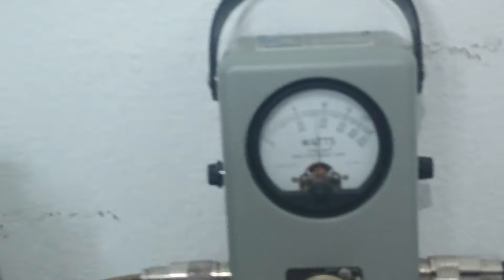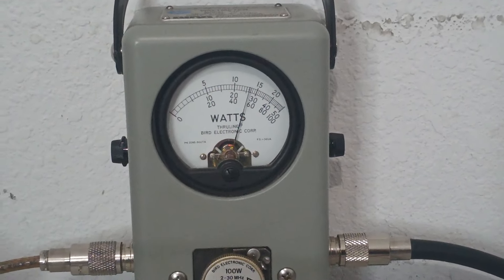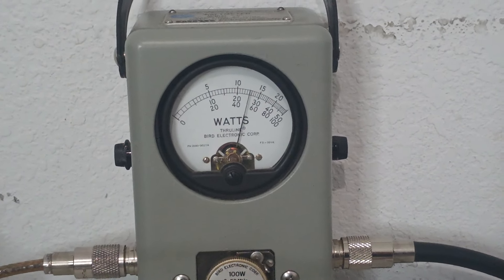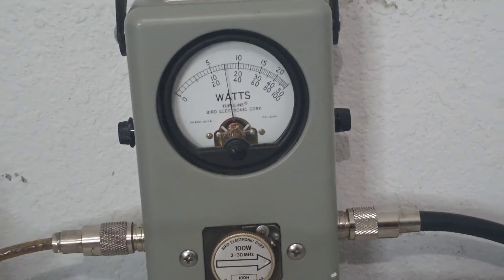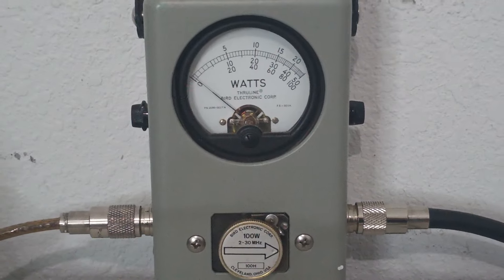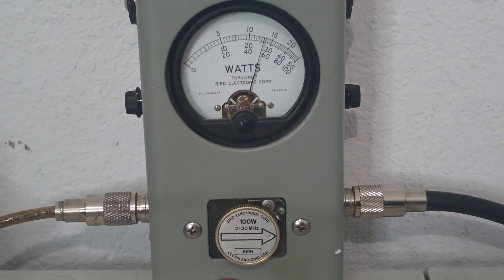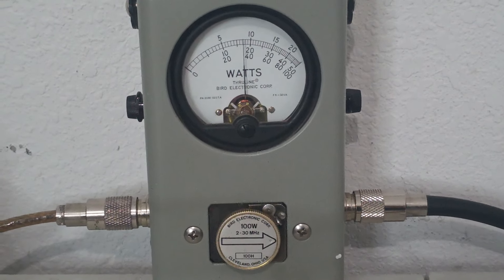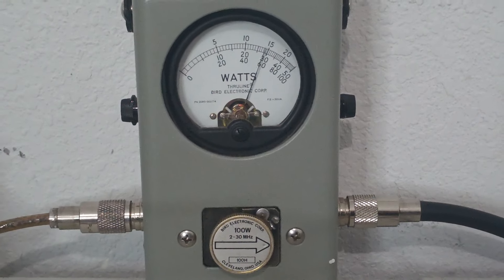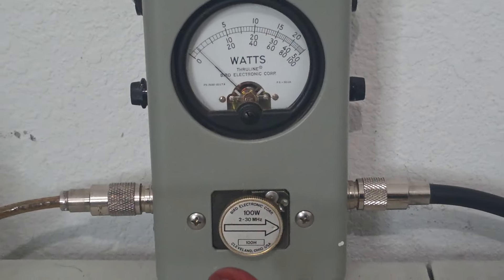PEP all the way down — this is on AM by the way. Audio check, one two three. When you run them all the way down they do lose a little bit of modulation. You can kind of see how it's trying to hold it back. And if we audio into it, it won't go over as far. The high tone doesn't respond — it actually responds better to a lower tone. You can just tell the way it's kind of bouncing that it's lost a little bit of modulation.